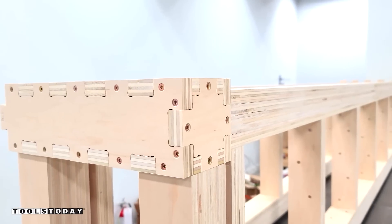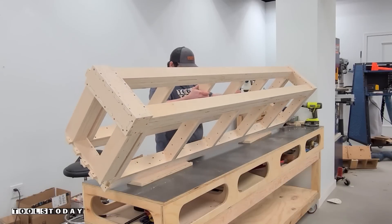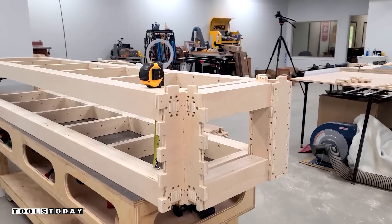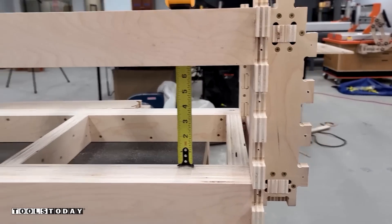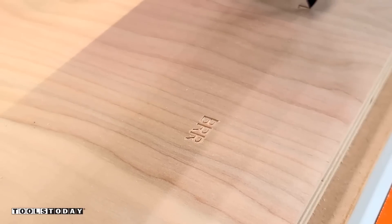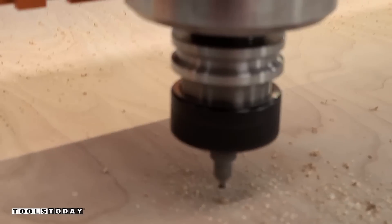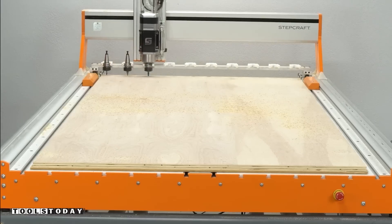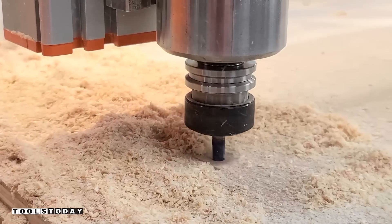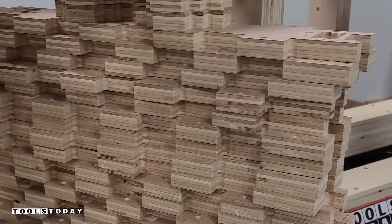Unfortunately I made a pretty major mistake here. I made some sort of error in the design process and didn't have the piece sized out correctly — this is exactly where I realized that mistake because that gap looks really short and it is. I planned to have a much larger area there to put a cabinet in later. So we needed to recut some longer legs. We'll move through the process using the V-bit, then use the countersink bit to drill all of those countersinks, then pick up the compression bit to do all of the remaining cutting. That will cut out the legs that are the correct size this time — it's about a five to six inch difference between what I had and what these are going to be.